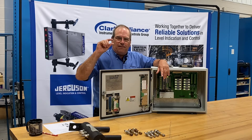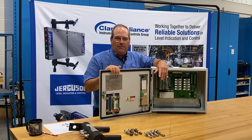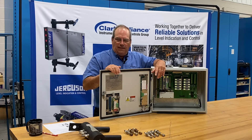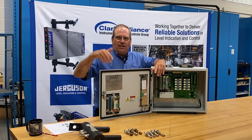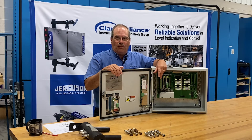The minimum spacing from probe center to center is 1 inch or 25 millimeters, and there's no maximum in between. We've made columns that are 18 inches connection centers on up to columns that were multiple feet in length to suit your boiler application.